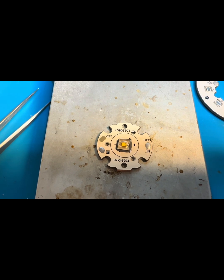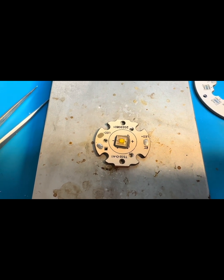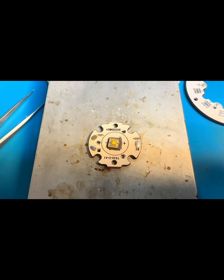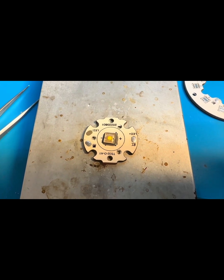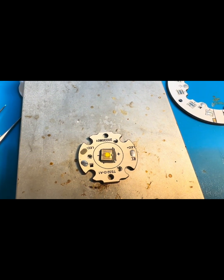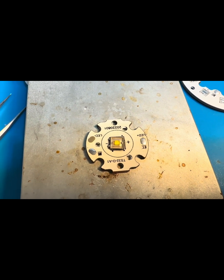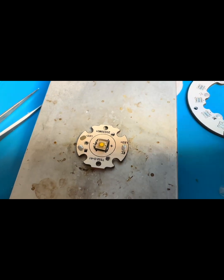So here is the center LED - it's a 3000K L50 - and I'm going to show you how solder paste turns into solder. As it's heating up it gets softer, and then once it reaches temperature around 183 degrees Celsius, per spec, it'll turn into solder. It's got almost a magnetic effect where the solder sucks underneath. There it goes - you can see the little balls on the side. Once this happens I make sure the LED is lined up, then tap the top to get the old balls out of the way.